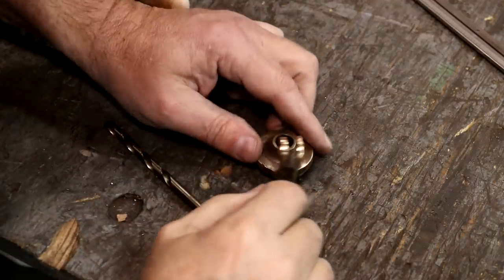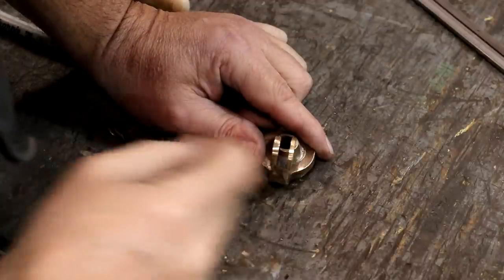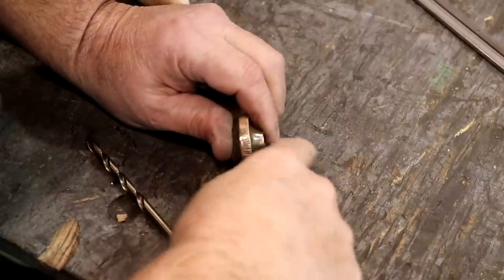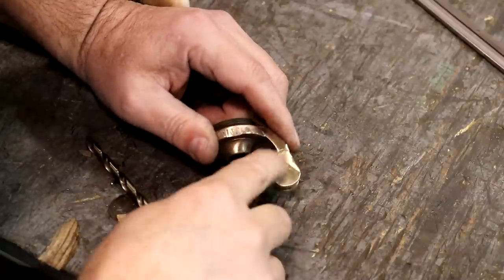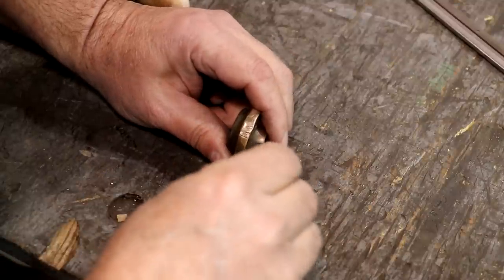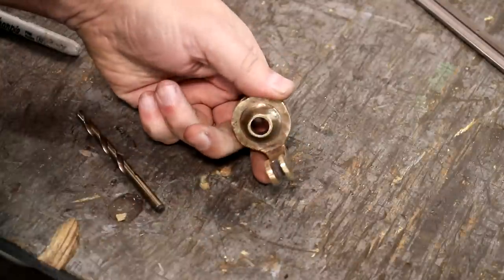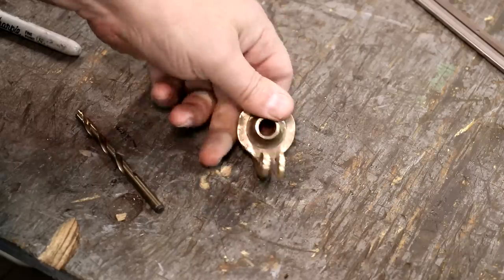I'm pretty happy with that. You can tell this material is not quite as thick as the original, but it's pretty close. It appears to be welded on there pretty good. I did kind of match the radius on both sides — it's pretty close. If he wants to fine tune any more, he's more than welcome to, but I think it's a pretty good match. Last thing we need to do is put a hole through there — a quarter-inch hole. We'll go over to the drill press, put that in, and I think we're going to call this part done. Hopefully that repair will last and hold up for him.